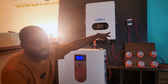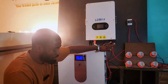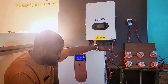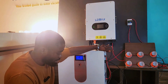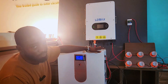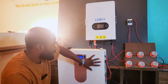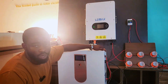This battery is rated 10.2 kWh. At 80% DoD, we are supposed to consume at least 8,160 watt-hours — that is 8.1 kWh — from this battery. With 8.1 kWh to pull and drawing 4.5 kW, it will take approximately 1 hour 40 to 1 hour 50 minutes to complete the discharge.